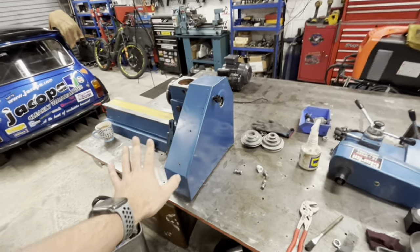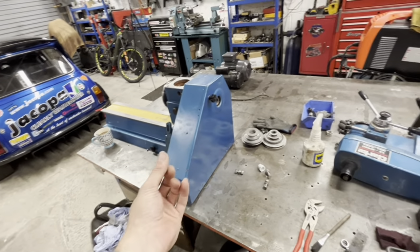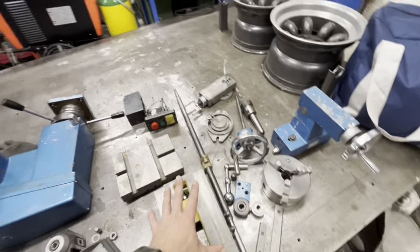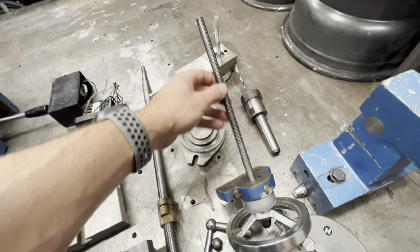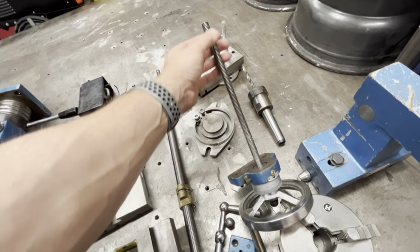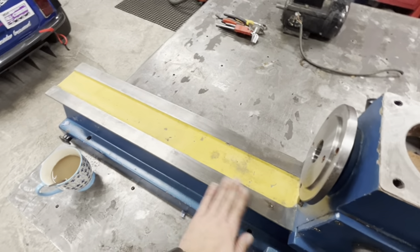You don't put grease in lathes where it needs oil — if it needs oil, it has oil. Grease sticks to grease so I had to clean all that off and get everything back to start. But this lathe is in much better condition than mine. These are acme threads and they are barely used. Mine are nearly worn out — you can feel they're a little bit sharper in the middle — but this lathe definitely hasn't had much use, it just hasn't been looked after very well.